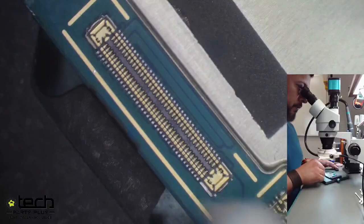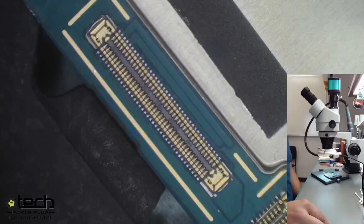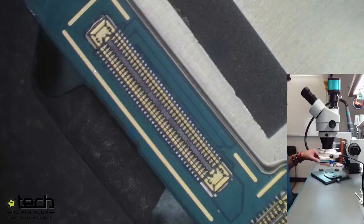This repair isn't necessarily difficult, depending on connector location. Where you really get into difficulty is with a layered board — such as iPhone 10 or newer — where you need to watch your heat levels carefully. The rule of thumb is don't heat for more than 60 seconds at a time. If it's not off after 60 seconds, stop, let the board cool, then try again — apply a bit more flux to help. Popcorning is a common issue from overheating, where solder underneath ICs like the CPU or NAND bubbles up, causing bridges or broken connections, leaving you with a non-working device.